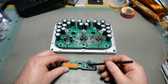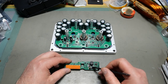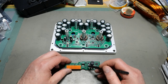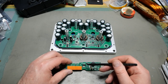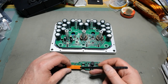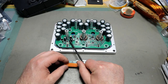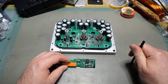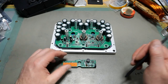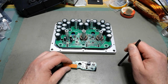This right here I originally thought was a 7805 linear regulator, but it's not — it is a MOSFET, and following its little traces they go over to those two pins on this connector. Most likely this MOSFET either turns something off external across those two pins, or you short those two together and then this MOSFET applies battery power to the main DC-to-DC, which is right here. This is a very common way that controllers are powered up — simply power up the main DC-to-DC and then everything else gets power and just starts working. Extremely common way of enabling controllers. I've seen it in literally hundreds of different controllers from different sources.